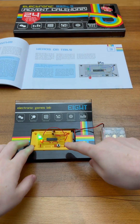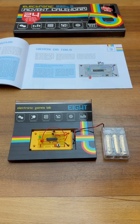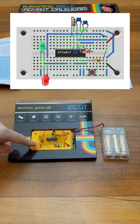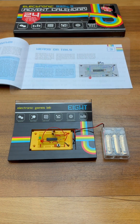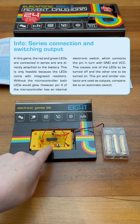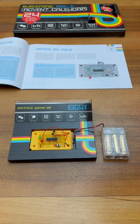I'm going to go for red. So how does this circuit even work? Well, our LEDs are connected to positive or negative by the appropriate leg. In this case, the green LED is connected to ground via this red link here, and the red LED is connected to the positive terminal of the battery pack by this long lead here. The microcontroller controls which LED is on using this pin here - by raising that pin high it means the green LED is on, and by setting it low it means the red LED can be on.